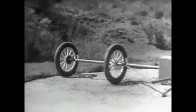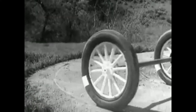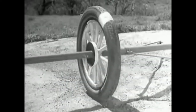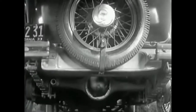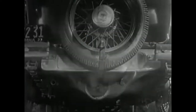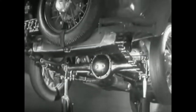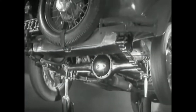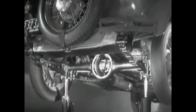But if two wheels are locked on an axle so that they are not free to turn separately, one or the other has to slide. So engineers had to find a way to connect both rear wheels to the engine without sliding and slipping on turns. The device which makes this possible is a part of the rear axle.